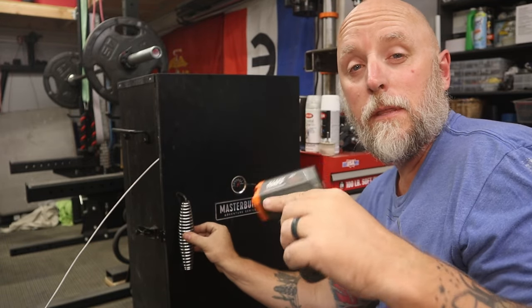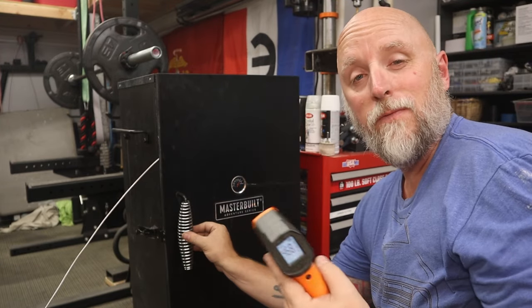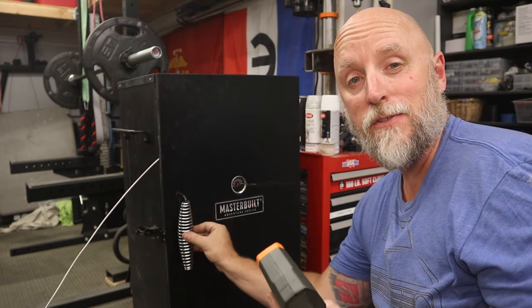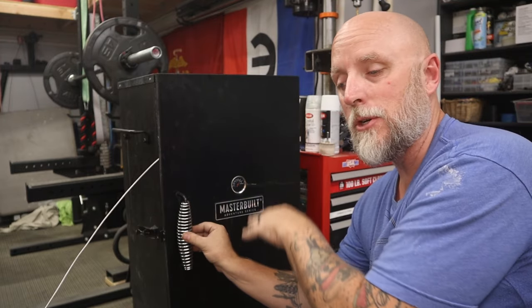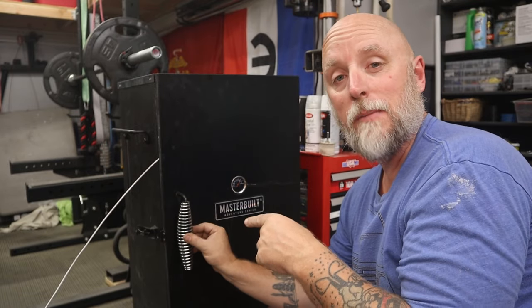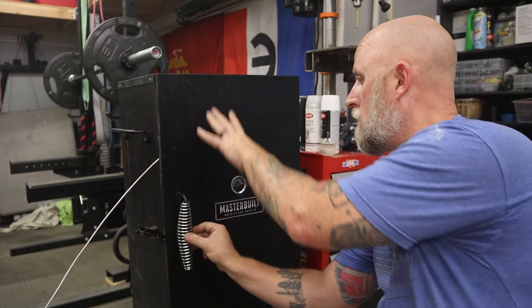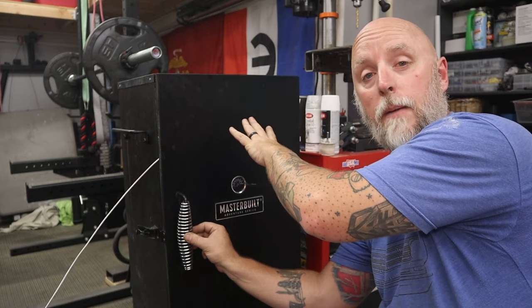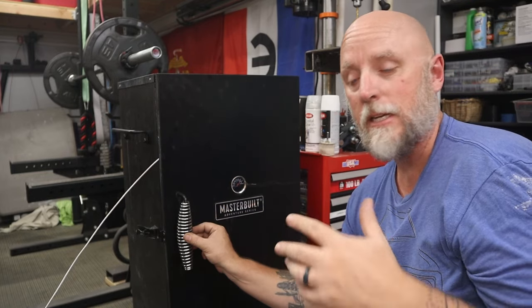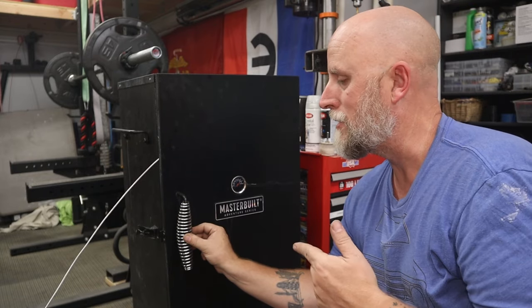Yeah, so the temperature at the top of the bracket, which is more like towards the center of the box, is 430. Down at the heater, it's like 468. So obviously there's a big temperature discrepancy, but it is getting up the temperature. So obviously one of the things learned here is that when it comes to doing the powder coating, I'll probably try to suspend everything or have it up on the shelf up near the top where the temperature won't be as drastic as down near the heater. That's something we'll play with when we actually try powder coating something.